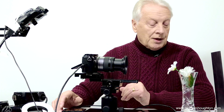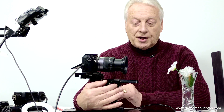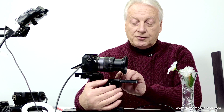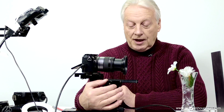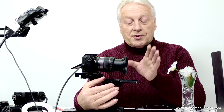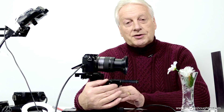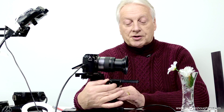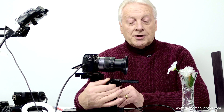This slider has a wheel on one side, and by turning the wheel you can increment or decrement the position of the slider relative to your subject. It's a geared drive and you've got a clamp plate on the side to add a little more tension and reduce side play, so you can move the camera forwards and backwards. For slices of one millimeter or less you can do this but without much precision. You can see the amount of movement by looking at the scale on the slider relative to a fixed index mark, so you can to a degree judge how much movement you're putting into each increment.